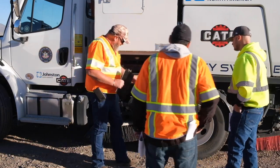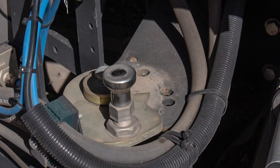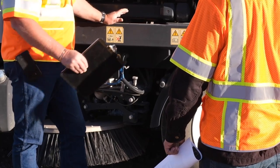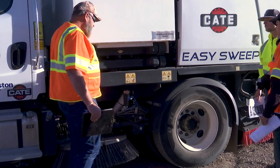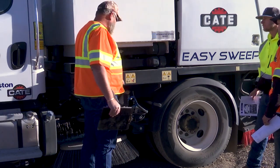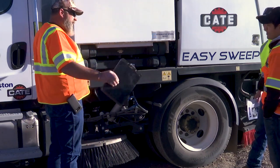This does have some manual stops on it. How you employ those is right through here — we've got three holes in this bracket. Maximum extension is going to be 12 feet wide. Then you can set them back to 10 feet, then back to 8 feet. Right now I don't have these set because the stops on this side have been worn out twice. They're still on the other side, but this one for some reason keeps failing. So when you employ these brooms, they're going to go to maximum extension.